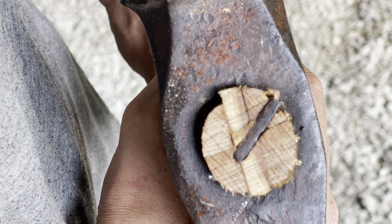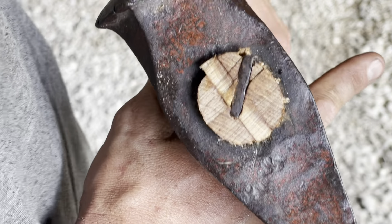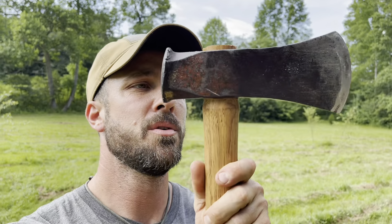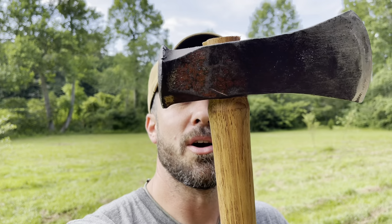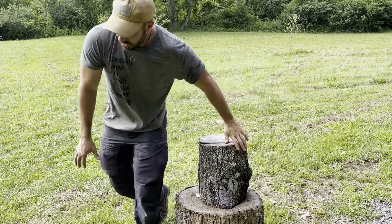That went way off to one side for some reason. The wooden wedge spreads the handle apart in this fashion and hugs the sides of the axe head; the metal step wedge spreads it the other way and locks everything in that direction. Not the prettiest job I've ever done in my life — it kind of actually bothers me a lot — but we're a little bit committed at this point. There it is, the finished product. It's not my best work, but it will definitely do and last me another half a decade or so. Here's a dried-out knotty piece of oak — that ought to be a good test to see if we did a good job.